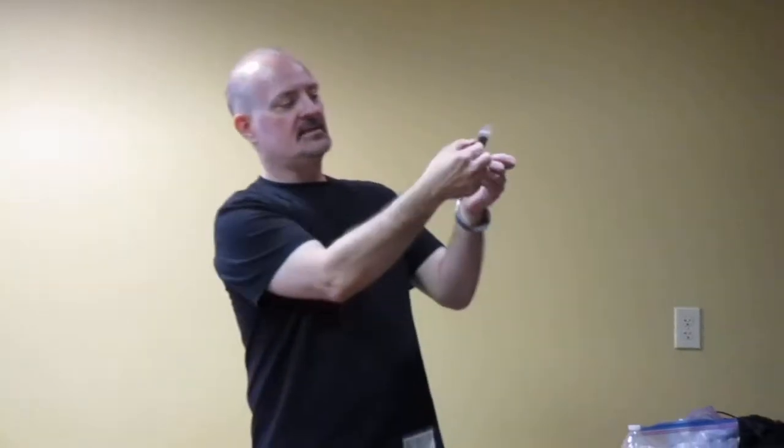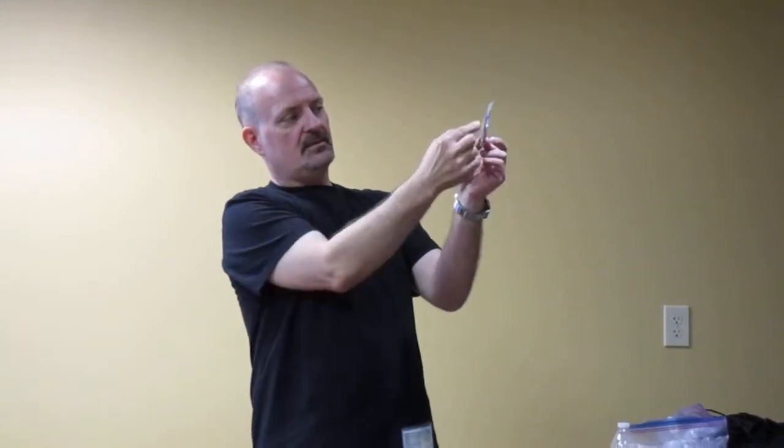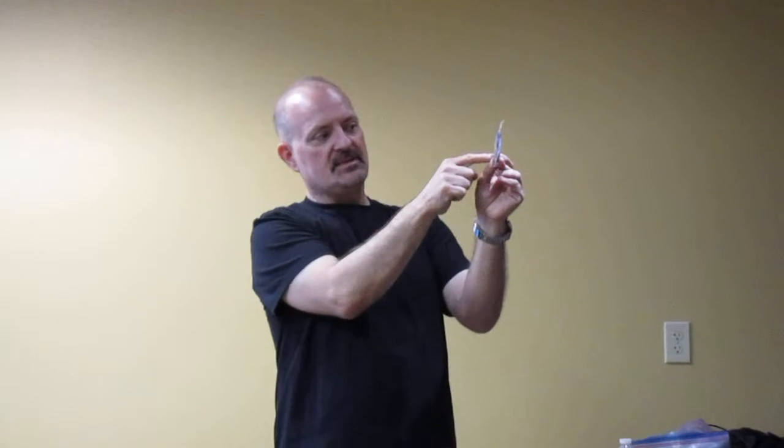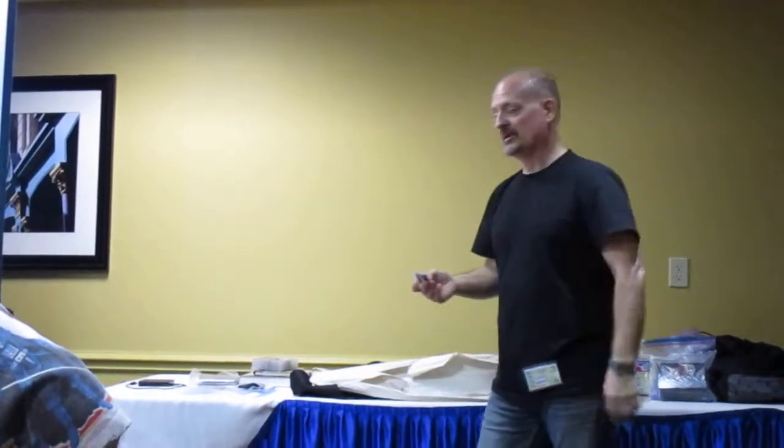In fact, how you can get this edge, this here that's got a step down, say you do this in three pieces. The center part is the most square, where the red is. And then do these two little black pieces, sandwich them together, and now you've got your three-dimensional part. You can paint them separately, then mask that area off. Wherever the glue's going, you want to show, glue it, put it together, then take the mask off, and you're left with a part like that, using plastic, balsa wood. And I know it works because when I was doing local Playhouse and theater, we didn't have budgets and we didn't have anything really. So whatever we could get, we used.